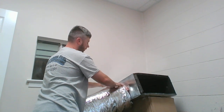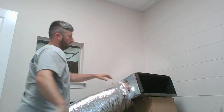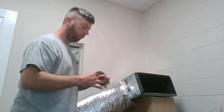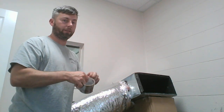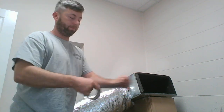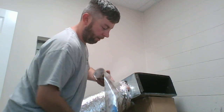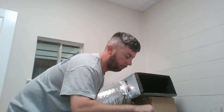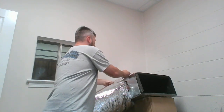And you'll notice that I've butted my insulation and foil jacket with a little bit of that pink showing through all the way up. Make sure it's all the way up. If you don't do this, it will create condensation sweat. Now, your tape here, take your time with this part. Use very small, controlled segments of tape. Don't run out a 3-foot piece of tape, because you're not going to be able to control it. It's just going to result in frustration.